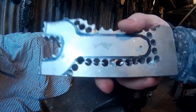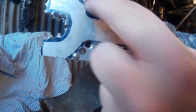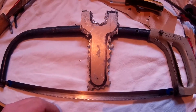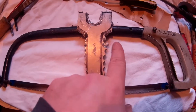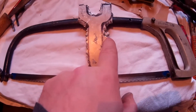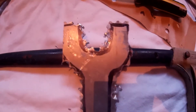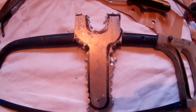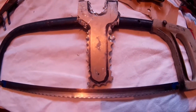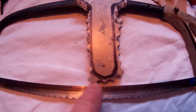Just carry on like that until you've got the basic shape of your slingshot. Now this is where a hacksaw comes in handy — you can cut off some of the lumps. If you cut the lumps off it'll make it easier to file later, though there is another method for getting rid of those lumps which I'll show you after. The hacksaw works but it is a lot of cutting — a long boring job even for not a lot of cutting.